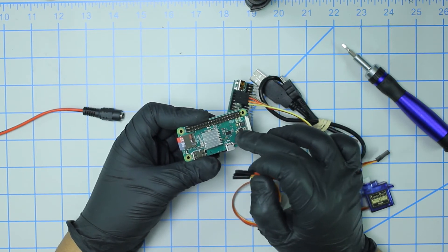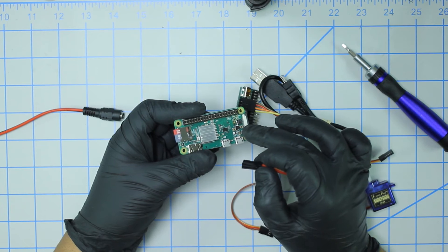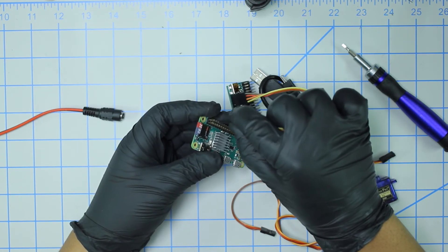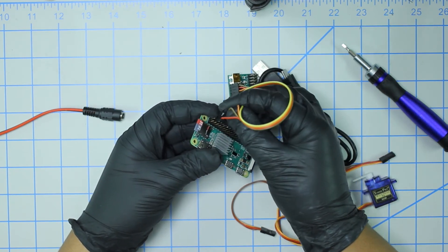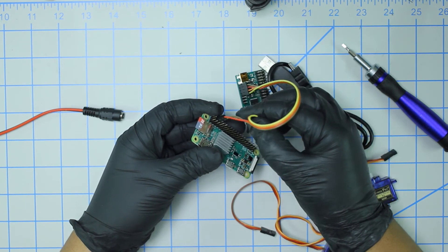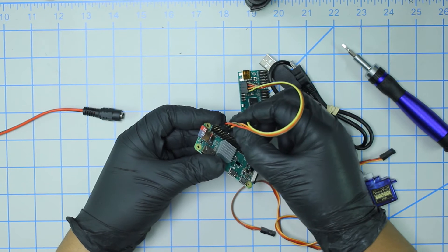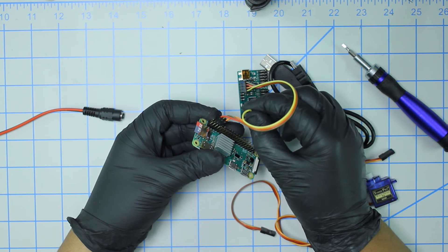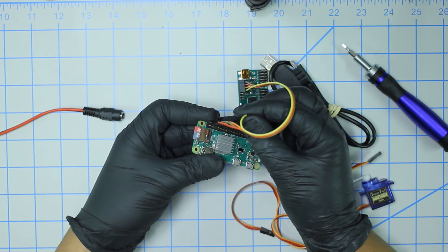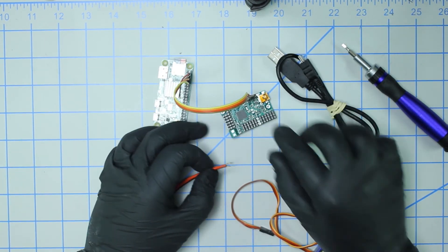A quick note: because the Raspberry Pi is set up a bit unusually, when we activate the TTL serial interface we're going to have to disable the Bluetooth functionality, because the Bluetooth chip runs by default on this TTL serial interface. If you have plans to use Bluetooth you'll need to go another route. Now let's wire up the Pi. Five volts is the second pin on the top row, ground is the third pin - so brown goes to ground. Orange was RX on the servo controller so it hooks to the TX pin, and the yellow GPIO jumper goes to the RX pin on the Pi.